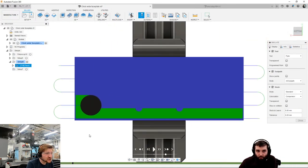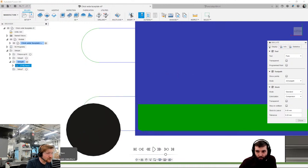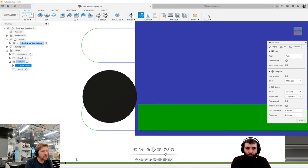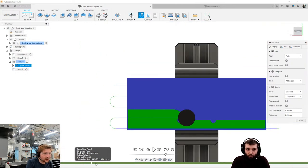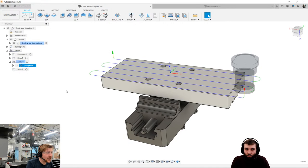So really nice tip to make sure that it doesn't do that swinging linking move and ramp back into your material and hit it hard. Because we all know that the same as why you've got differentials on a vehicle is the outside moves a lot quicker than the inside. So imagine how quick the surface speed is here. Really quick. So I want to make sure that I've got out of that weird swinging motion before I re-engage the material. That's what I've got there. Facing, going around, coming back, and going all the way across our part. Hopefully that was a nice top tip there. I'm going to try and pack this with as many top tips as I can. And we're going to go from there.